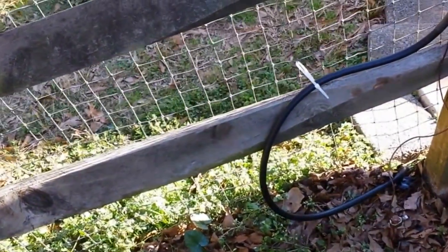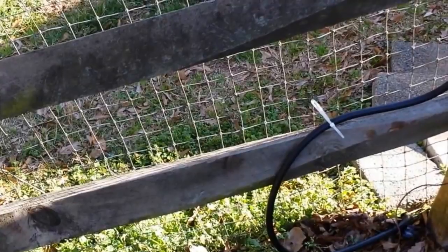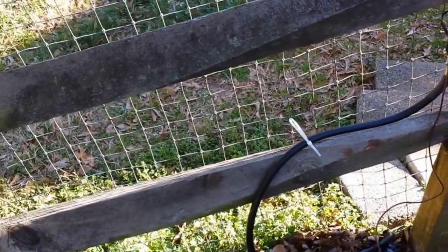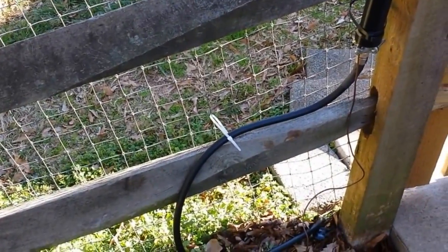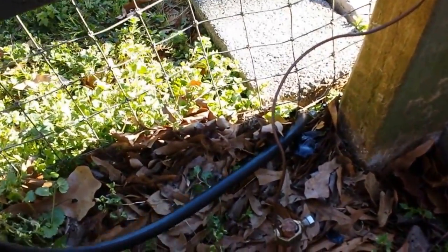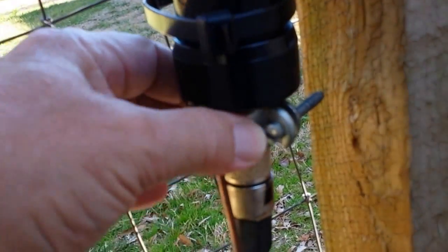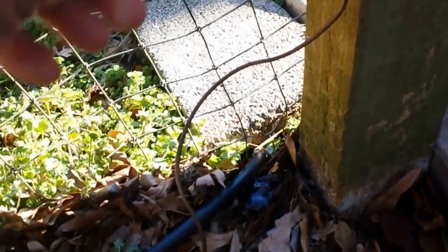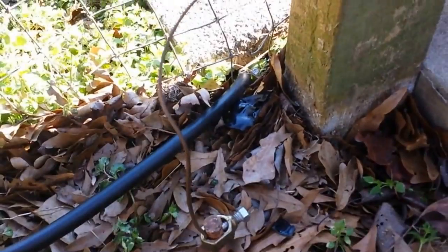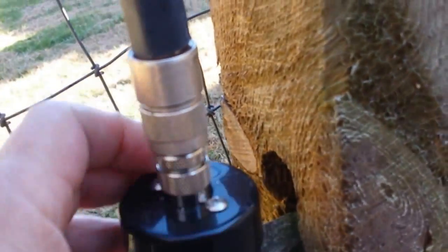I thought I would demonstrate how I have my antennas. This is the MEF 330 NFED antenna that covers 80 through 10 meters. Here's how we start out coming out of the ground with our coax, going to the choke — this is the My Antennas choke 3K model. Here's the ground wire; we've got a regular ground clamp on the coax going down to an 8-foot ground rod, so it's properly grounded. This coax is LMR 600 with a connector on top.